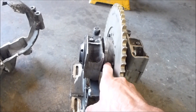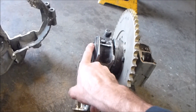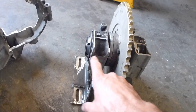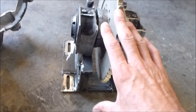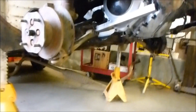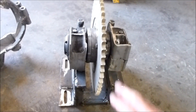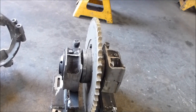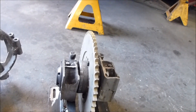I've used the Honda 600 differential. The spider gears are in here, the CV flanges are here, and these are the bearing holders which I cut off of this broken block. This whole unit bolts up in the bottom of the car as a cartridge and will allow a service to replace the sprocket when it wears. This is made out of aluminum and they do wear, or you can change the sprocket to a smaller gear if need be.